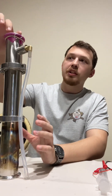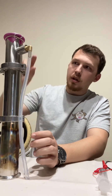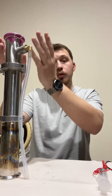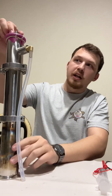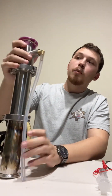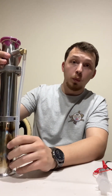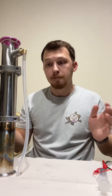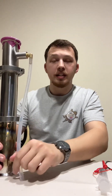Eventually you get to a point where it's almost 100% vacuum and there's just a small amount of air moving up and down. As the hot air rises it cools because it's away from the heat source, then it falls back down, causing the diaphragm to move. It needs to be at somewhat of a vacuum, because the diaphragm will move down when the air is down. When the air is cold it returns to its normal compressed state — a vacuum — and when heated it's expanded.